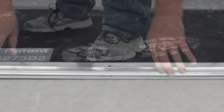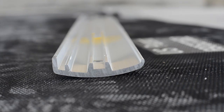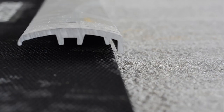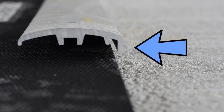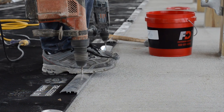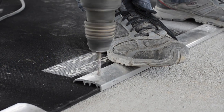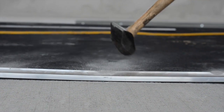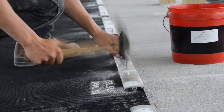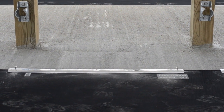Start with the first bed in the run. One aluminum strip is placed at the top of each bed. The smooth side of the aluminum strip should face up. The long lip on the bottom side of the aluminum strip should be tight against the edge of the bed. Center the strip between the fill tubes. Drill five anchor holes through the rubber and into the concrete using the entire length of the bit. Starting from the center hole, place an anchor in and drive it down, then drive the anchors on either side of the center in completely. Drive the outside anchors in only halfway — these will be driven in completely only after filling the beds and securing the fill tube closure.